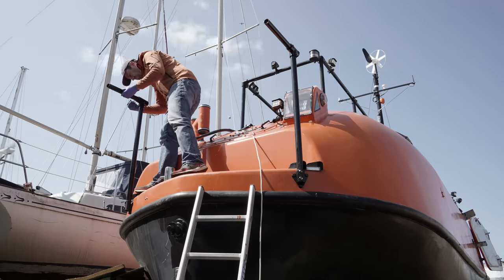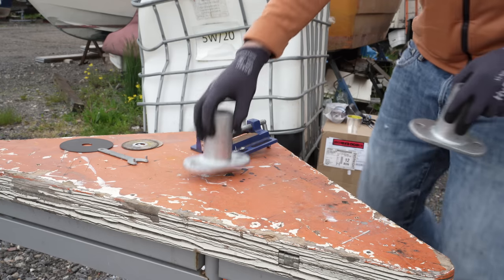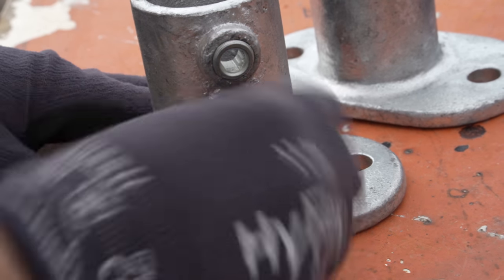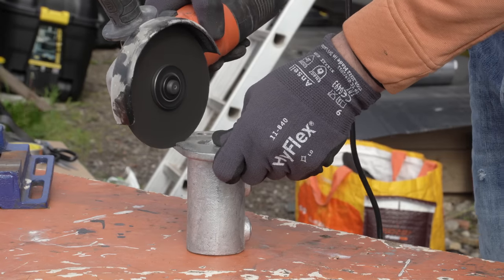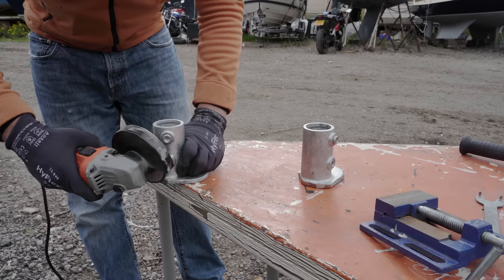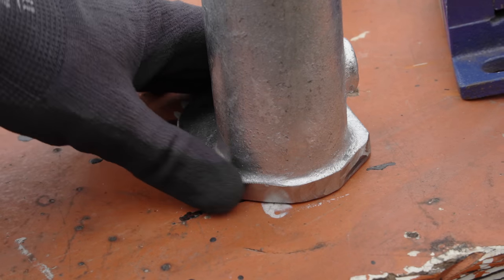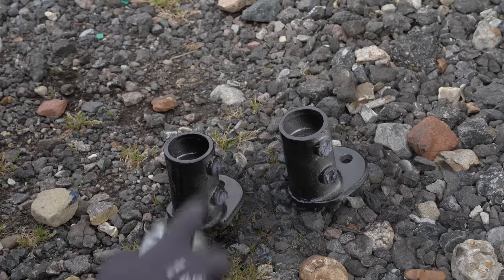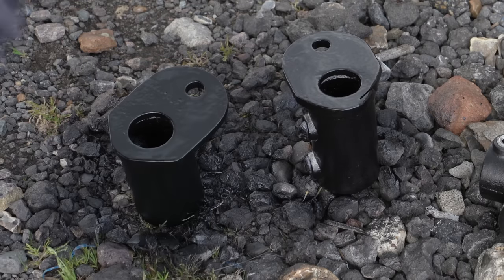On the ends of those, I now need to do a little more customisation. These flat plate brackets are a good start, but not quite right. I don't need both ends, as one would end up sticking out, so naturally I'm going to chop them off. A few grinder cuts, and one misjudged cut we will never speak of again, and the rough shape is done, to be cleaned up with the ever-present flap wheel. They looked very smart once they both went through the spotlessly clean painting shack — remembering to get plenty inside, as sea or rainwater pooling inside is probably worse than direct water splashes from the front.